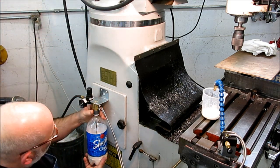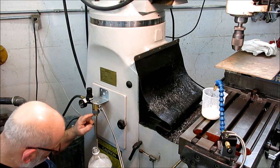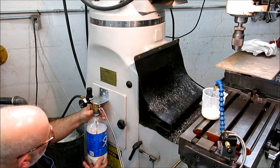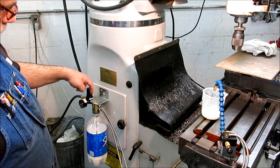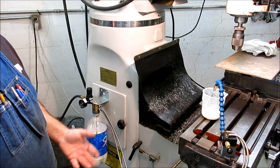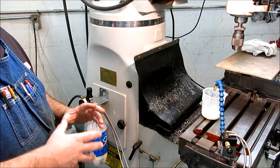I matched the thread on the bottle — it's a buttress thread, a weird bottle buttress thread — and then there's a gland seal here. You just pop that on, slide it on your gland like that, then thread this on and it pulls up and seals it. There are two lines: one is air and one is liquid. The air comes in, takes a right turn, goes down and pressurizes the bottle inside. Then when we open this valve, it brings coolant up the dip tube and through the coolant line, so I can get pure coolant. And then there's a straight-through path for pure air, so I can get any combination of pure air, pure coolant, or a mix thereof.